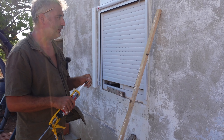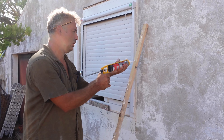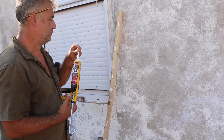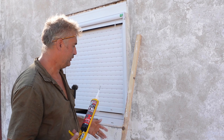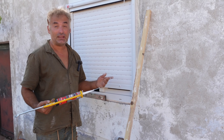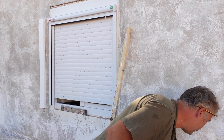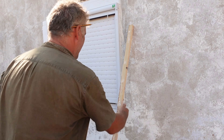What I've done is put a tiny bit of T-Rex glue on the batten wood — not a lot. Make sure the T-Rex glue does not go on the outer face of the wood that will be facing in, because if it splurges into the wall where you render, it can pull your render off the wall. The batten then goes to the line, like so.